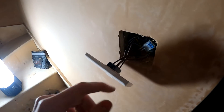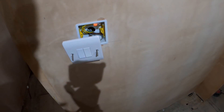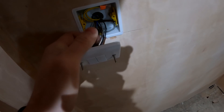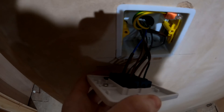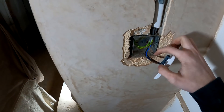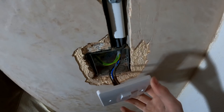The earth is in the box terminated. Moving to the next switch behind me - this is the third switch and it's pretty similar to the previous one but there's a twin in there rather than three-core. All sleeved up, bending into place and screwing back. In this final switch: gray is common, blue and black together in L2, and both browns in L1. Earth in the back box - normal gist.